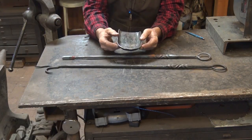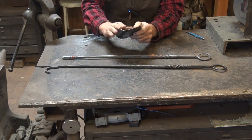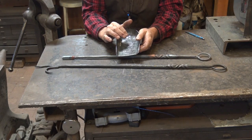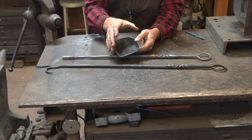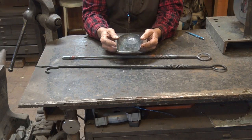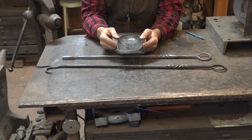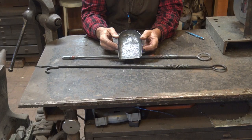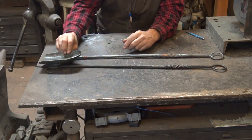I went ahead and took this to the grinder, evened up the sides and took off any rough spots. Make sure it's round — people aren't going to handle this shovel a lot, but you don't want sharp edges, so kind of ease these over and round them up just a little bit. The exact shape of this pan is entirely up to you. Mine is this shape because it's pretty much what my little swedge block does. They can flare, they can be hourglass shape — hourglassing is going to be a lot more difficult on a stump or an oxygen cylinder, but if you make one of those vice-mounted torch jigs it might not be so hard.